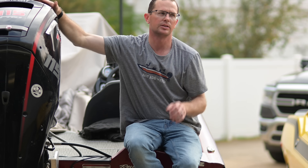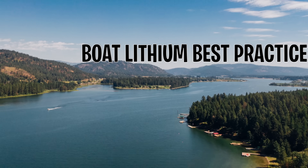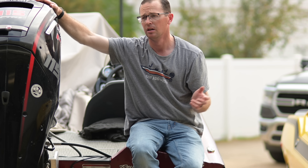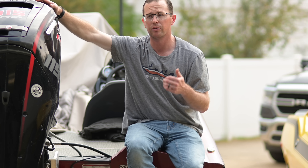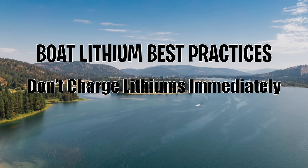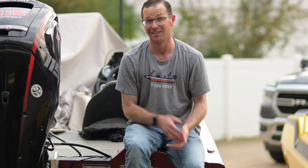So here's a summary: one, don't oversize your batteries. If you do, make sure you're operating them in that sweet spot. If you need the full capacity for a weekend trip or a two-day tournament where you don't know if you'll have power, then charge them all the way up — that's fine to do occasionally. But for day-in and day-out use, keep them at lower states of charge. They're going to be a lot healthier and last a long time. Remember, your boat is being stored more than it's being used, so follow those manufacturer recommendations in that context.